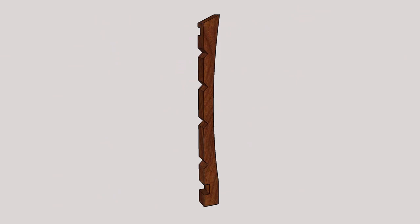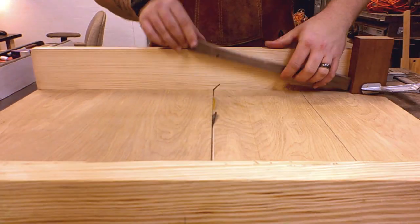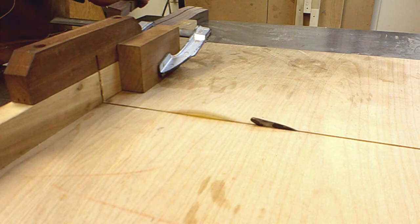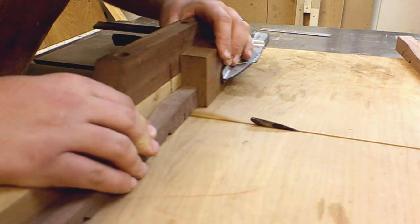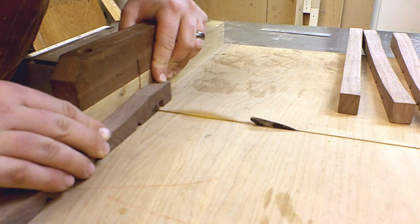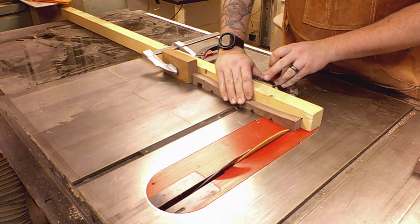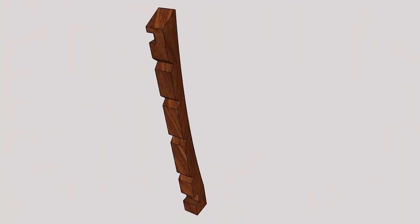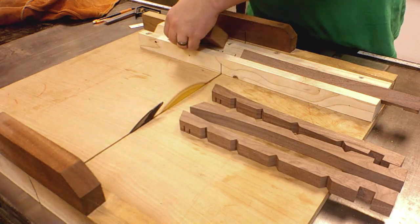Now it's time to start working on the case joinery. Each leg will receive four 45 degree notches for the diamond drawer guides to attach. I use my template once again to line up my cuts. Once I find the proper alignment, I add a stop block for repeatability. Once I have the first four cuts made, I flip everything around to cut the second half. Here I have the legs on the crosscut sled and am cutting each side of the dado at the bottom — this will receive the curved bottom cross members. With both sides cut, I remove the stop block and clean out the center. Finally, I use my miter gauge with my saw blade tipped to 25 degrees to cut the top angle. The top of the leg needs a notch bisecting the leg at a 45 degree angle to receive the top panel, so I outfitted my crosscut sled with a 45 degree V-block.